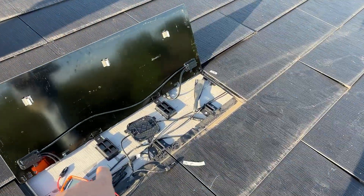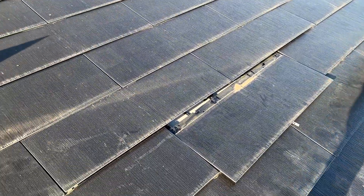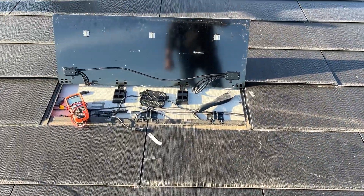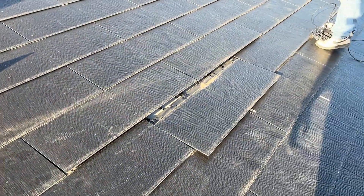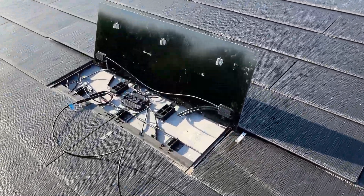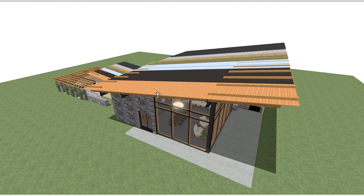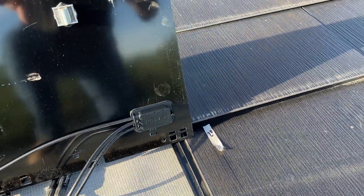And then they're able to pop this one up. They're going to pop one up over there. So it's super easy to test and troubleshoot if you have a problem. You've got that two inch air gap underneath. If you watch my other videos on air gaps and roofs, this one really shows how the ideal way of it is.